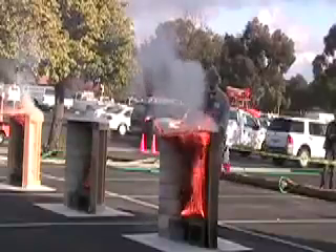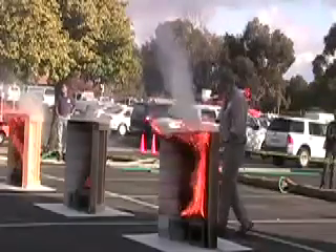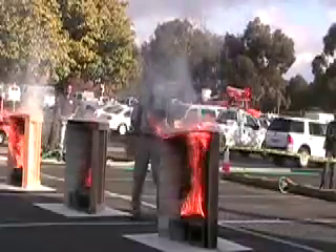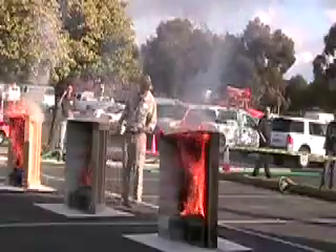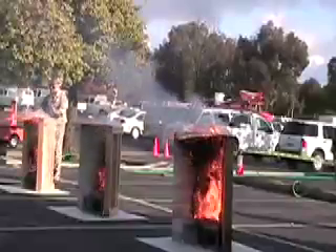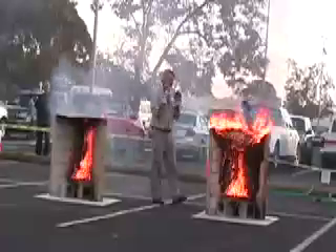We'll look very clearly at flame penetration from the back here, and this is going to be burning through in a minute. You had several minutes of lead time in terms of the flame penetration. With the fiber cement product, nothing has happened yet in terms of flame penetration. Where the flame will likely penetrate is at the trim. And with the panelized product, the flame has already penetrated at the vertical seam on the right-hand side. The point here is that once flame has penetrated into the building cavity, it's pretty much lost because it can find its way through your house.